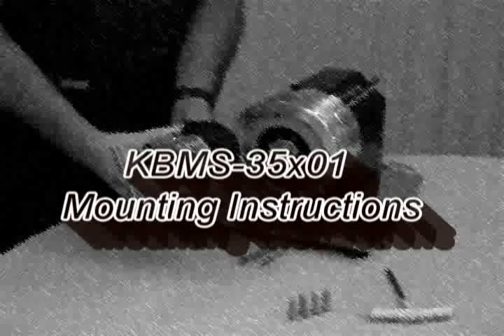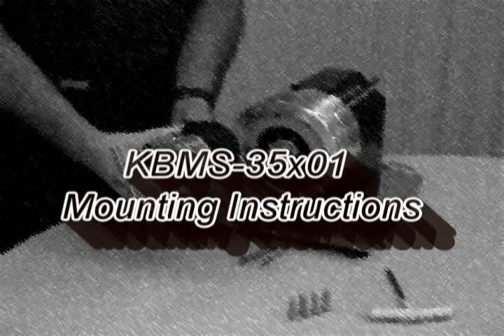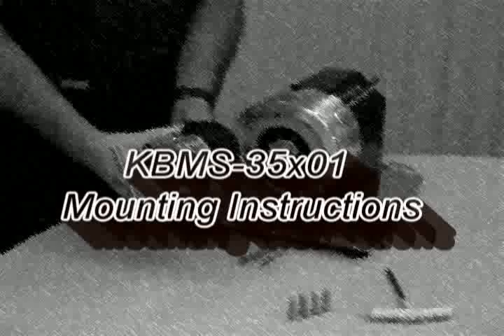Be sure to use the jack screw when mounting and removing the rotor assembly. Also, when lifting the demo unit, lift by the base to prevent damage to the feedback shaft and to avoid injury.